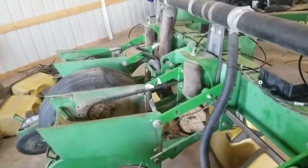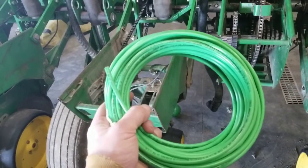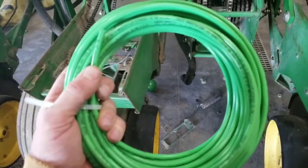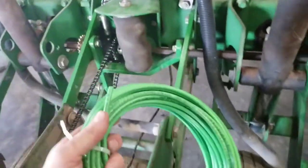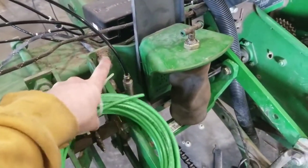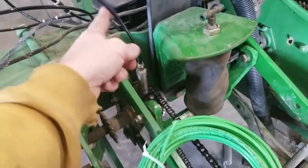I've got all 12 airbags installed — now it's time to plumb it up. Before I get started, I'm going to get on my soapbox a little bit and talk supplies. This is quarter-inch OD DOT-approved air brake line — that's actually what you're going to use for pneumatic down pressure, and that's true of a John Deere and also true of Case. The True Count tube is also quarter-inch OD but it is eighth-inch ID whereas this is more than that.